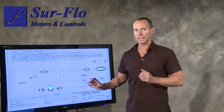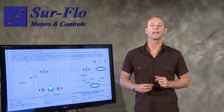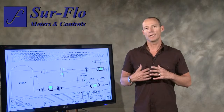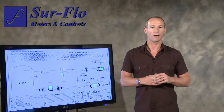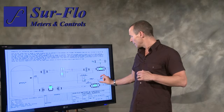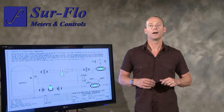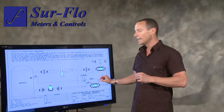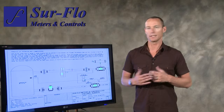Now if you've got other problems in there, where you've got sand and you don't want that really high volume because it's tearing out trim and stuff like that, in that kind of situation we can tweak it back. What we would do is open up the restrictor valve. By opening up that restrictor valve, when this opens up, it takes a little bit longer for that gas to get out of there. If you pinch it right down so that the CV is very small, when this opens up, it snaps out of there very quickly, and the valve opens almost instantaneously.